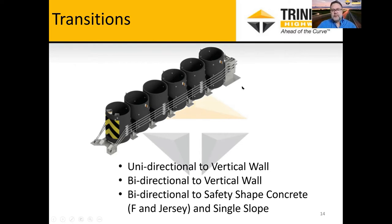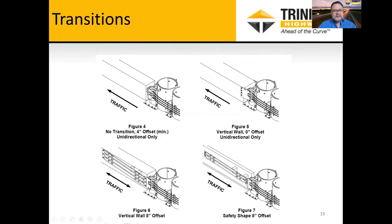As far as transitions: this is a standalone system. If you have a 10-inch or 12-inch vertical concrete wall behind it, you can just put this in front of it in a simple application for hazards up to 30 inches wide. If you want to use this in a median application where you may have traffic coming on the backside, that's when we need to get into transitions. We do have one specific design for a vertical wall 30 inches wide. As long as the system is offset to fully protect the hazard behind the backup, this allows for wider hazard protection with the wider backup we now have.